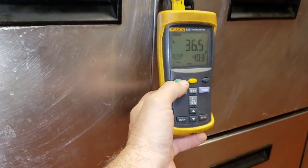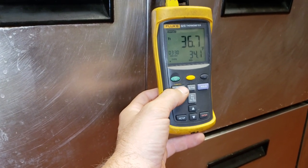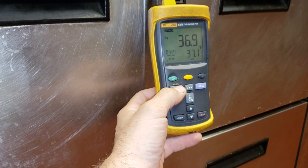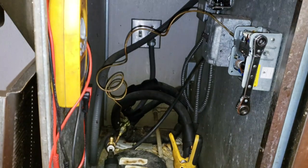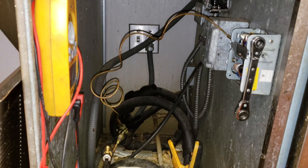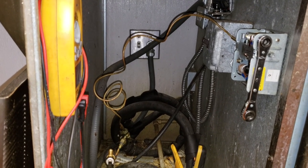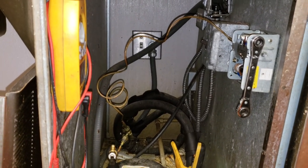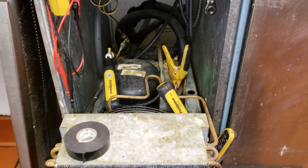On my thermometer, my max temp is 40.3 degrees and my minimum temp is 34. So the box comes down to 34 but cycles back up to 40 - that's perfect. That's the most split I want to put between there because if I go any colder I risk freezing their products, since the air blowing off the coil is a lot colder than 34. We don't want to freeze their lettuce or anything - I'll explain a bit more in the recap.